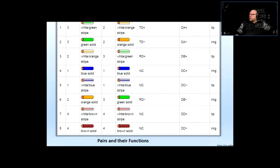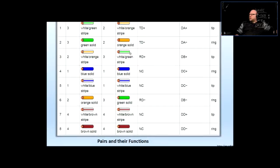And the green or the oranges over here will be receive data as a tip, receive data positive, and here we go, receive data negative, so we also have a tip and ring. We got here tip, orange, and ring here. So that's how you look at this table here.